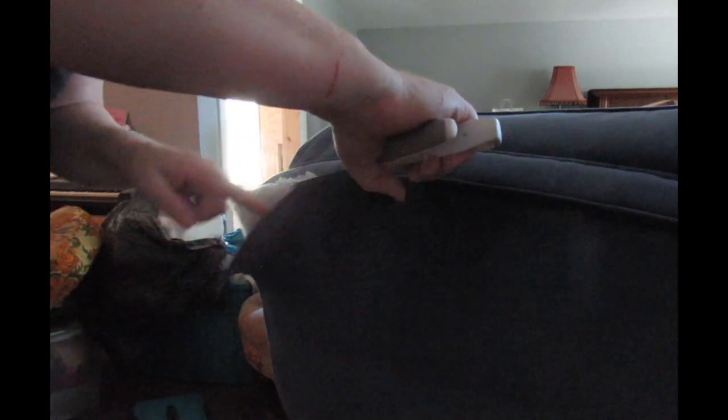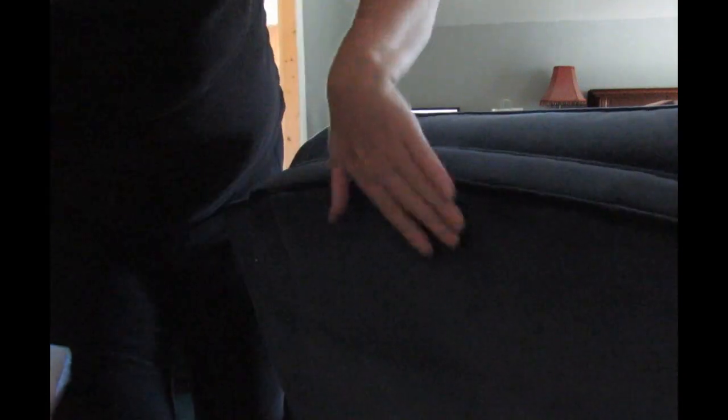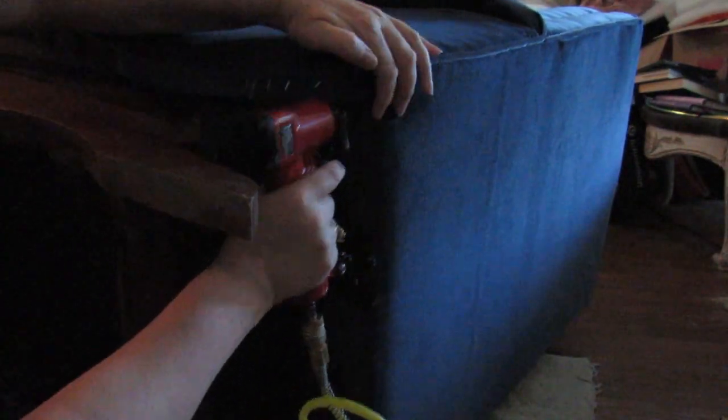Pop that in, pull that down, pull that little bit out, really work that into the crease, and then close it up. I'm going to cut it along the top again, a little bit generous because I don't want to cut it too close. I'm going to cut the white back a little bit more because if there's too much of that you can't get the fabric to catch. I'm going to hold this over so it's square on and ease that behind here. Once it's in place — all but the last inch — that enables me to turn it on its side and do what I need to on this side. I will seal it there and there. The blackout cloth I'm going to roll back and put at least an inch underneath so it doesn't show on the back. Nobody will see what it looks like and now I'll just do the other side.